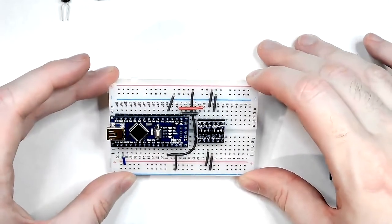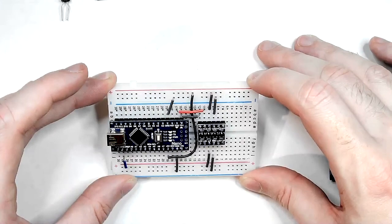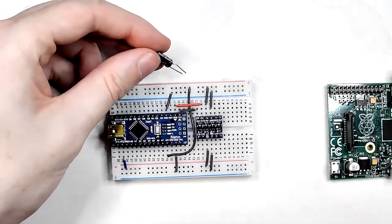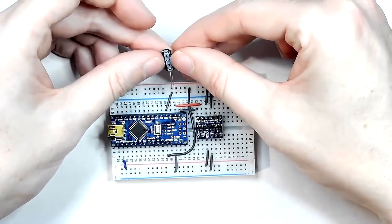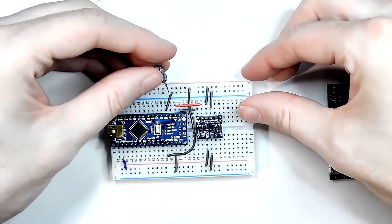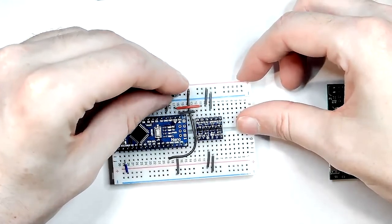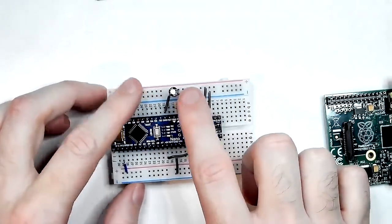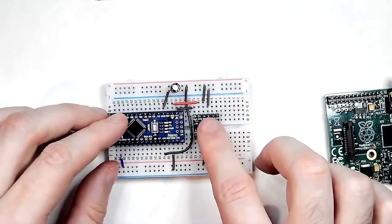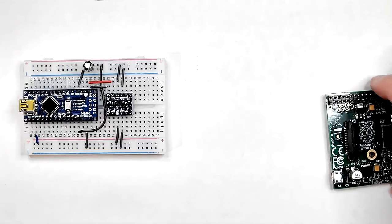Check the wiring to make sure everything is in the correct position — it all looks good. If you want to, you can now add the optional electrolytic capacitor: add it to the 5V rail with the stripe facing the blue negative rail, positioning it roughly in the middle of the board near where the power source comes in. And believe it or not, that is the bulk of the main build done.